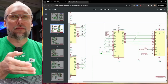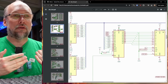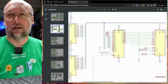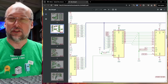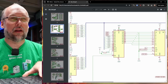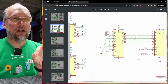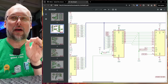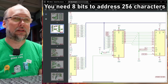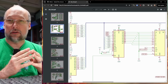On this computer, it's probably similar because this thing supports a monochrome mode, which has a higher resolution font versus the CGA mode. So it's probably a similar situation where if one address line is set low, you're getting the CGA font, and in the other state you're getting the MDA font. When you look at the address lines, which are used to select which character is being displayed, you'll notice that the first three lines, A0 through A2, are connected to the RA0, 1, and 2 lines. And everything else is connected to CC0 through 7. Remember that IBM PCs have a character set of 256 characters, which is made up of 8 bits. Now, A3 through A10 select which character is being displayed.